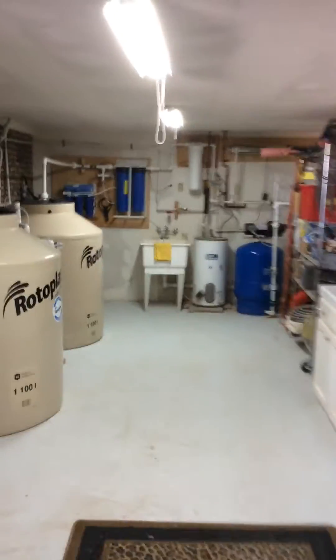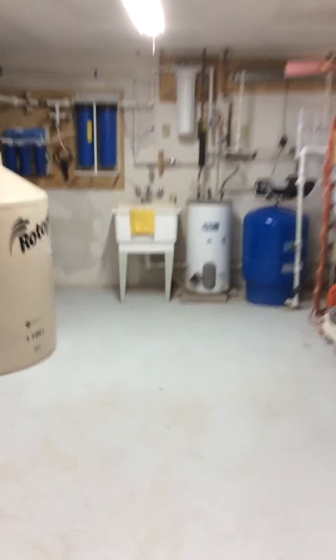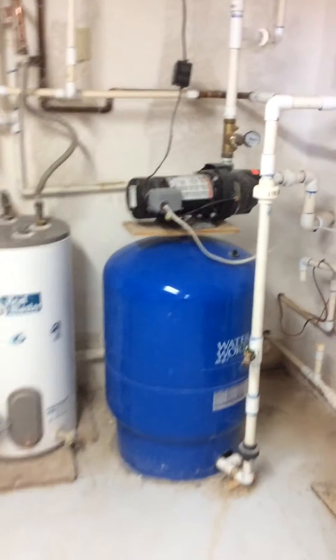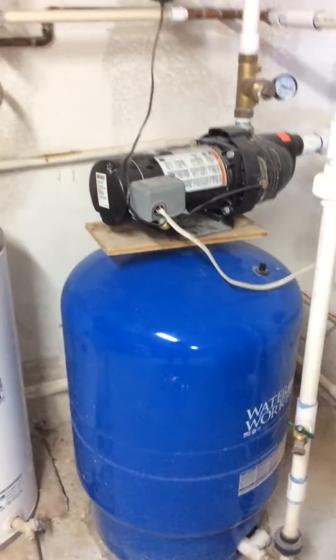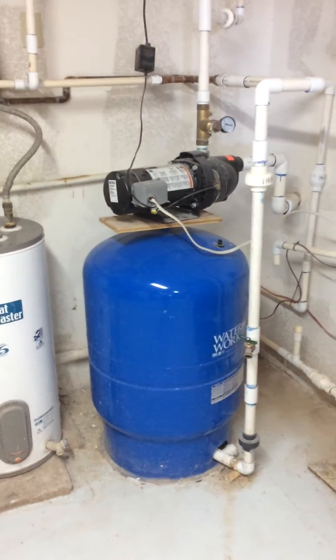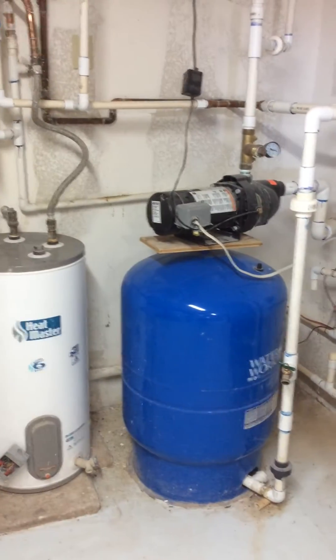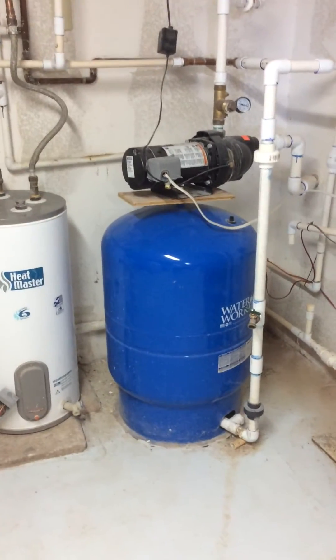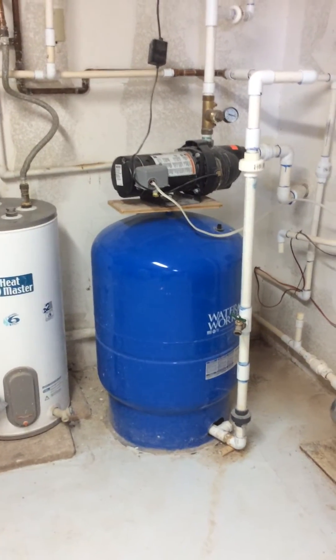I have it come over to a jet pump system — a jet pump with a bladder tank. The bladder tank keeps the system pressurized so the motor doesn't have to work so hard. I also have a low pressure cutoff switch on the jet pump, so in case the water runs dry, the pump won't continue to run.